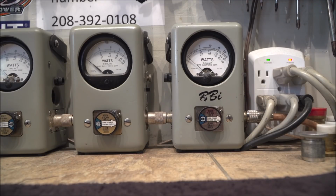It's at 15 and a half. We're going up to 16 and a half. Hello. About 1,500 watts peak. Hello. And nearly 600 Bird. And that's with the plain Jane everyday radio into it at only 16 volts.